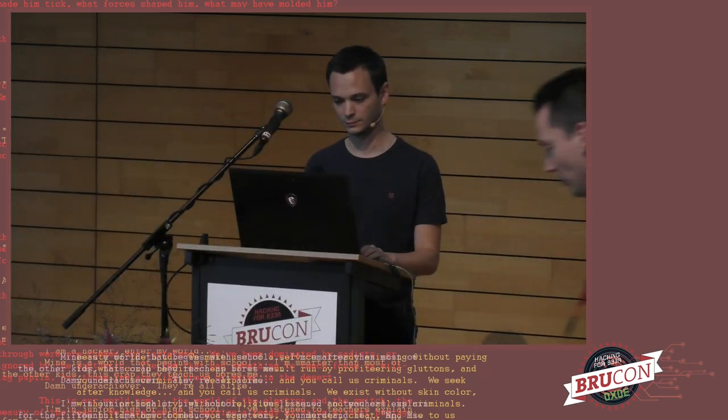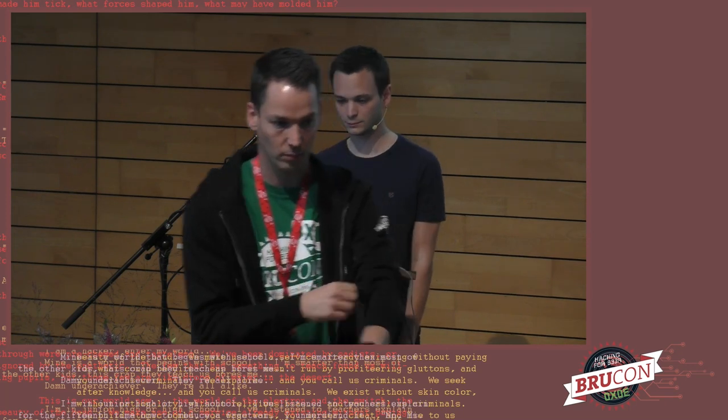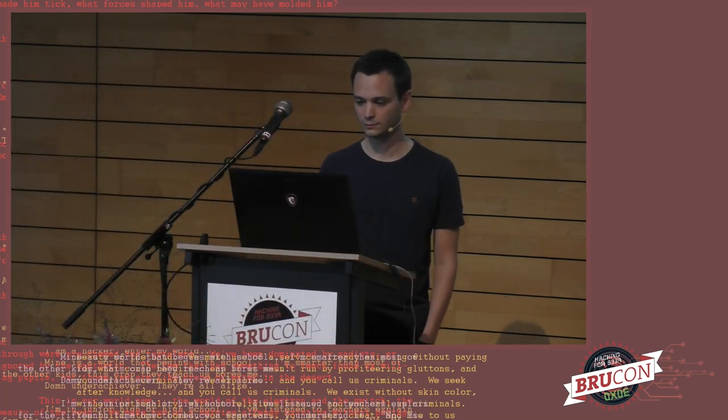In one of the photographs, there's a probe attached near the CPU core area — that was our EM side channel probe used to measure electromagnetic emanations from the chip to help us determine the timing of operations like signature verification inside the ROM bootloader.